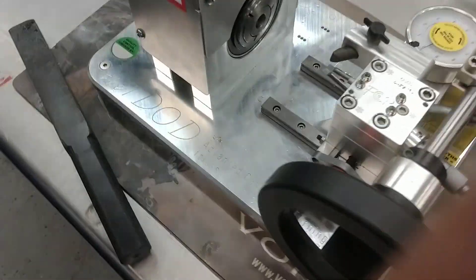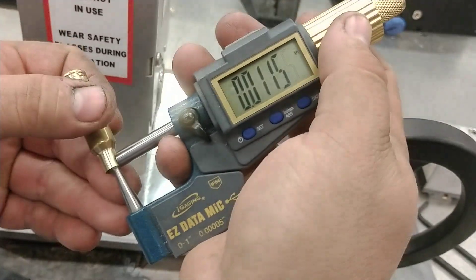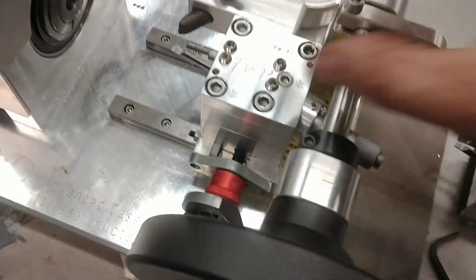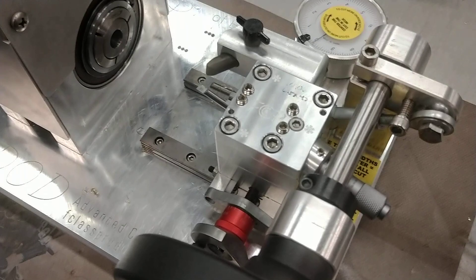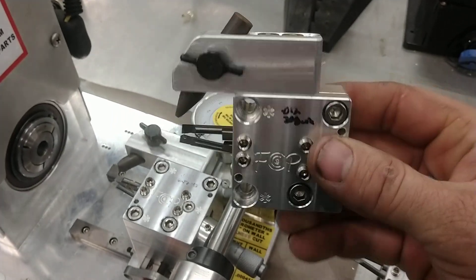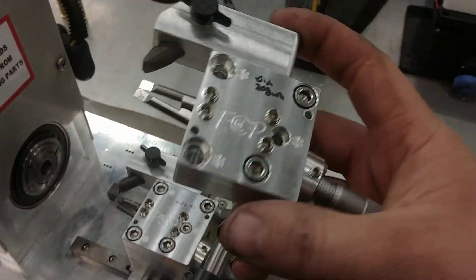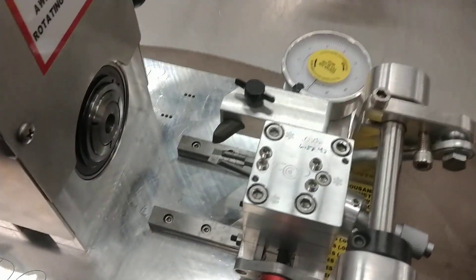You can see the quality of the cut. Checking our thickness — 11.4. So you can see 11.4, and 11.5 was the preset thickness. As you want to swap between different cartridges, we have a modular way of doing that. You guys can purchase extra cutter blocks — a lot of you already buy multiple cutters. You can buy just the cutter block itself if you want to swap your shoulder stop bracket over, same with the micrometer, or you can buy the whole assembly separately and interchange them without having to swap different parts. That's us showing you the new modular cutting block design.